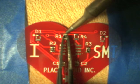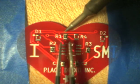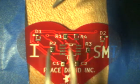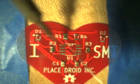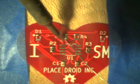So once again, soldering iron in the right hand, tweezers in the left, pushing down on the component and then touching the solder, and it just goes click and sits really flat on both ends, right? So now I'm getting the last resistor. This is R4, which I'm going to touch up. I touch up the other side of that one.